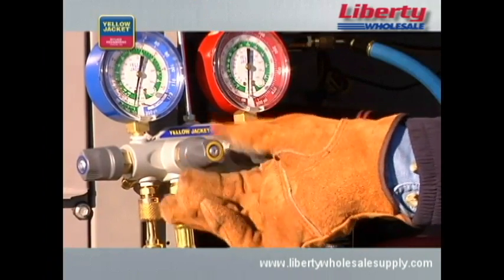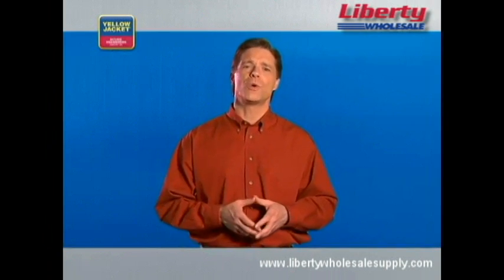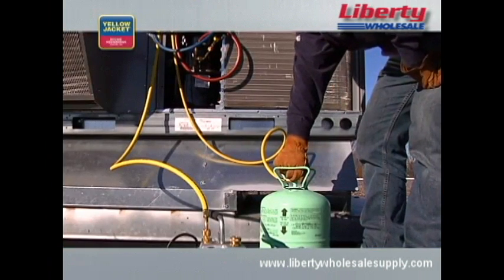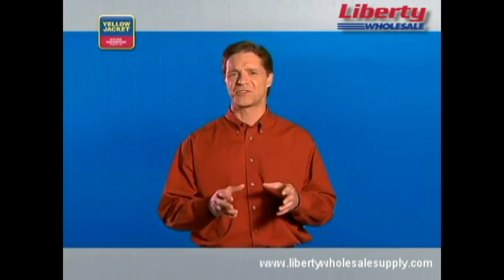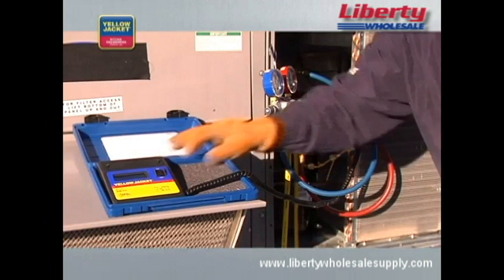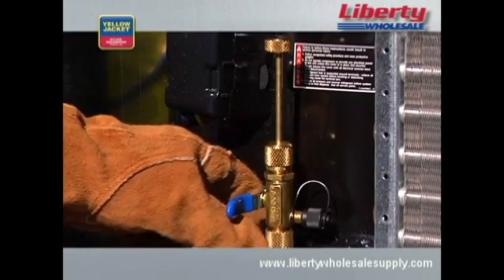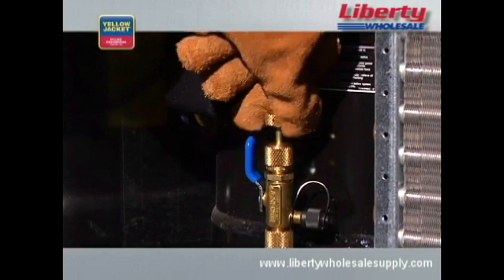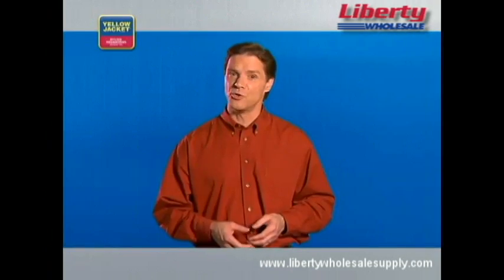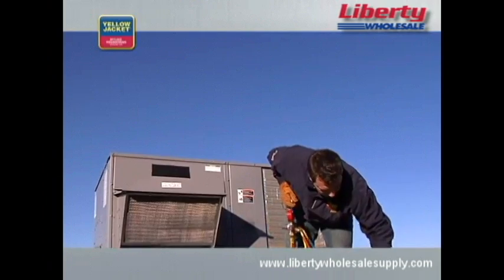Check the system manufacturer's recommendation for tolerance. Once you're satisfied with the reading, close the valve that connects the manifold to the pump. You can now shut off and disconnect the vacuum pump — your evacuation process is complete and you're ready for system charge. To charge, open the valve on the refrigerant cylinder. Add enough refrigerant to create a small positive pressure in the system, just enough so it registers, or about 3 PSI on the low side. You can now remove the electronic vacuum gauge and complete the charging process per the manufacturer's specifications. Once the charge is complete, you can replace the valve cores and remove the vacuum valve and core removal tools. It's a good idea to simply replace Schrader valves as they're not that expensive, and new valves will reduce the likelihood of system leaks. Screw them back in, seat them properly, remove your tools, and you're ready to go.